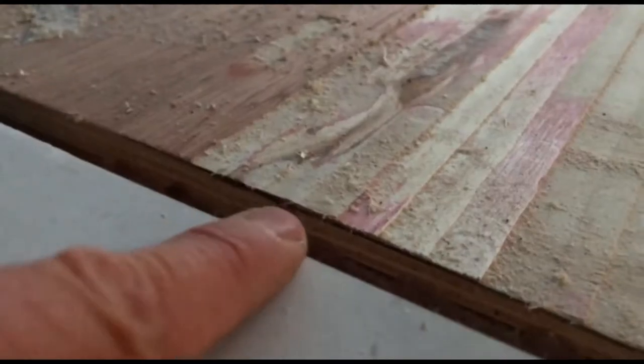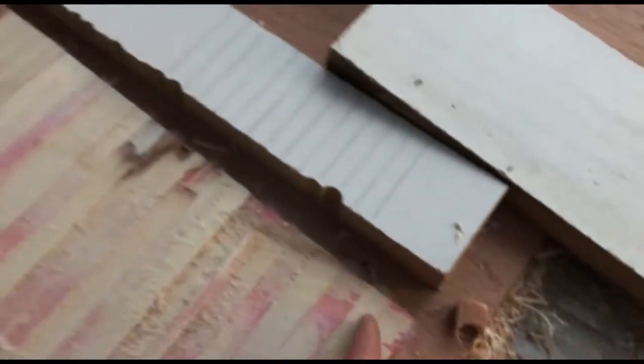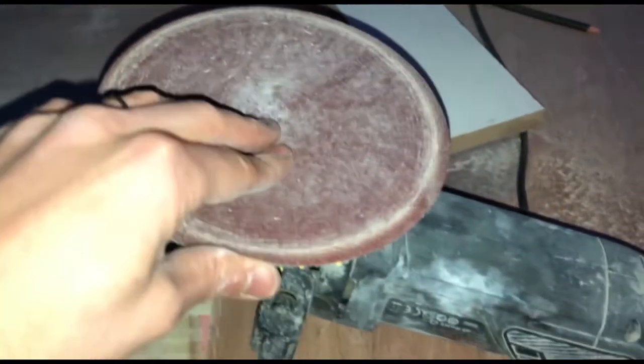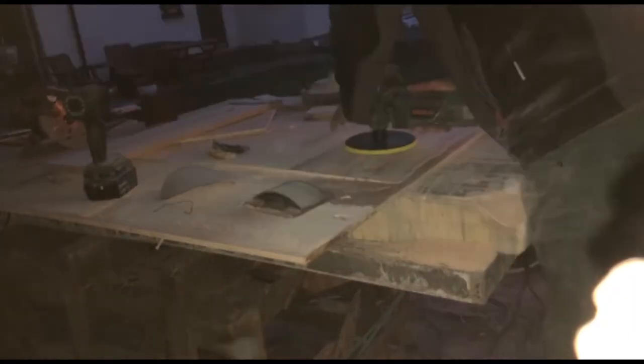Most of the work is done — the finishing line is here and we're very close to the line drawn along the edge. We're going to have a 25mm radius along these edges which I'll cut out afterwards, and there's going to be a sink cutout on top here. The best way to finish it is to use a polisher with some 120 grit sandpaper to flatten off all of those steps in the wood.